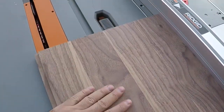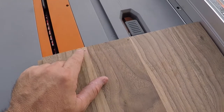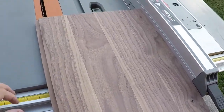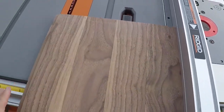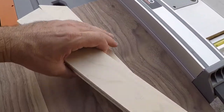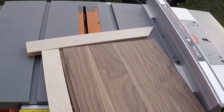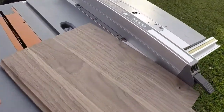I went ahead and glued the pieces together — I got four pieces of wood, these are roughly one by fours, and I put a couple of temporary tacks just to hold it while it dried. I sanded it down a tiny bit so I can move across the table. Right now I struck a mark on the center line and then figured out how to trim some off on the sides to get my 13 and a half inches. Don't forget we're going to frame it, so after the frame is on we want our end result to be 13 and a half inches wide.